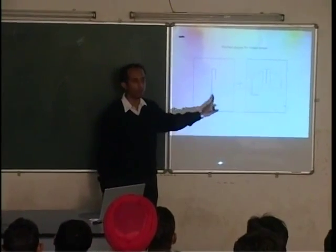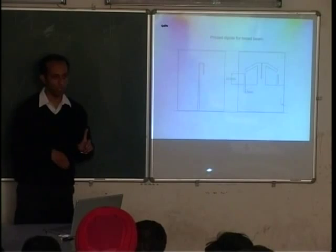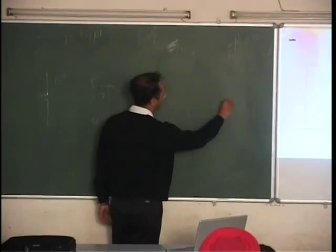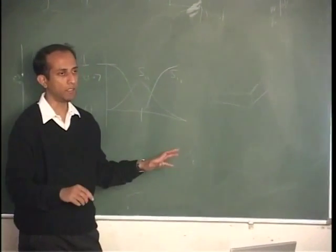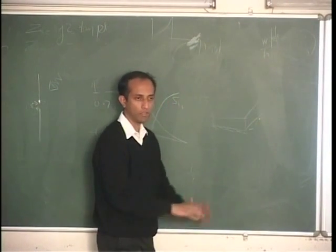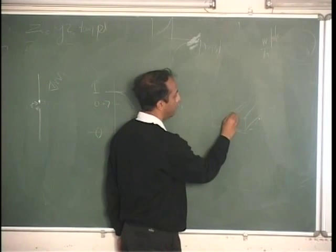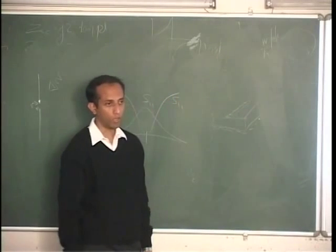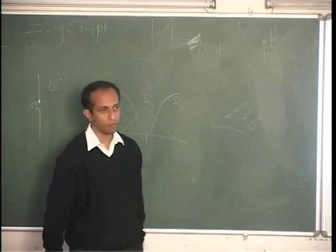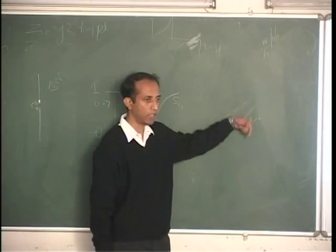This is called a microstrip. Have you heard of the word microstrip? Microstrip is a two wire transmission line. Okay, what are the two wires? So there is a dielectric layer, insulating layer, PCB you can say, for support. One of the wires is the back side, which is a big hard ground, and one of the wires is the top side, which is a strip, metallic strip. Okay, by choosing thin strip or thick strip, you can achieve something. That's called a microstrip. Important part is two wires, one wire, two wire, current goes and comes back.